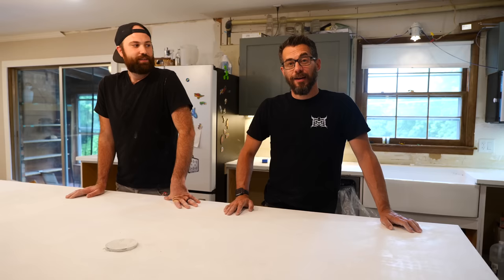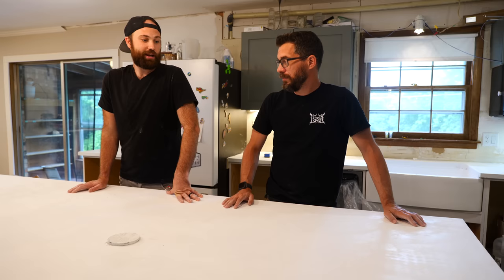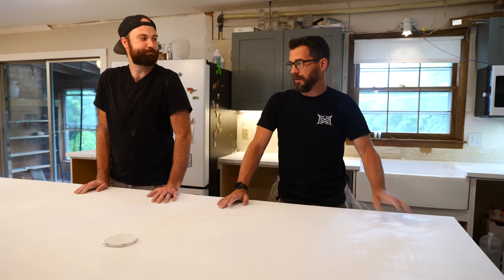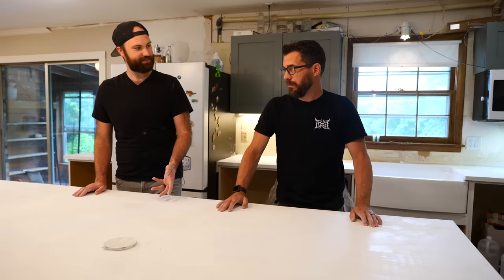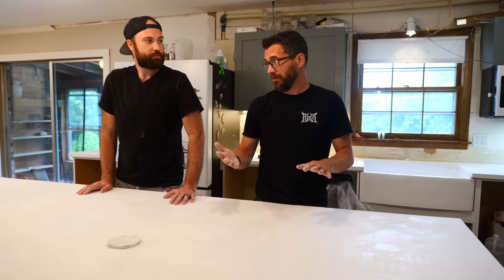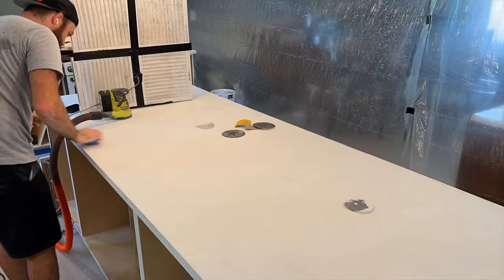The molds are off and I think they look awesome. There's a little bit of pitting on top but we've got some filler that will match the white, and we may do some sanding — though we'll test that first because sanding changes the color slightly by revealing the sand within the concrete. After that we have to take out the little plugs, drop in the outlets, get those finished and shimmed. Then we wait at least five days before sealing, and after sealing they're done.